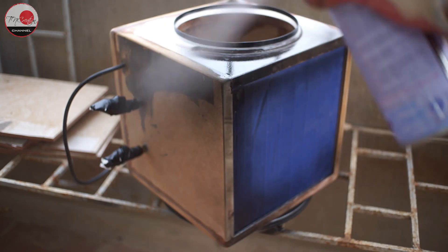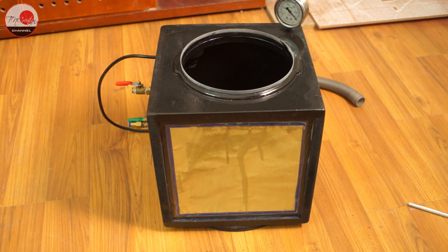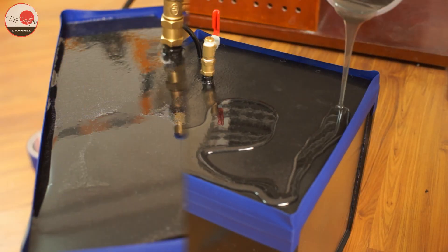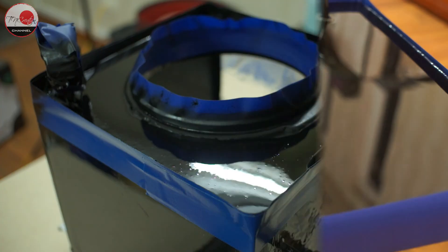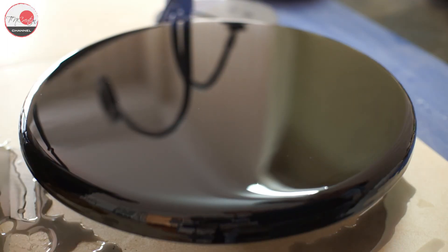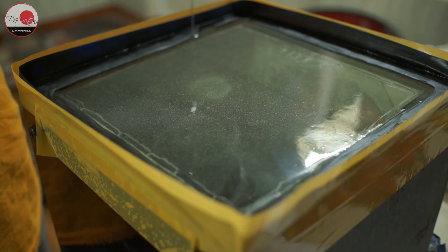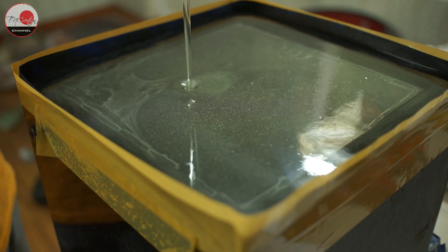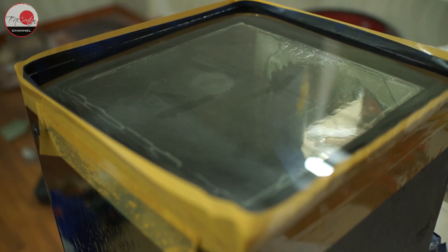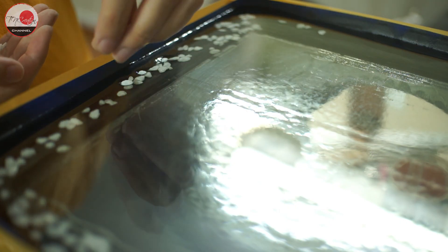After all these steps, it is time to paint the entire chamber in black — black is an easy choice as it hides any imperfections. I apply epoxy resin on all sides of the vacuum chamber for three reasons: it ensures the chamber is 100% air-sealed, it strengthens and protects the chamber, and it makes cleaning much easier in the future. I apply a thick layer of clear epoxy resin on the front face since it will handle quite a force during vacuuming. To hide imperfection marks between the clear resin and the wood border, I throw some white stones into the resin.